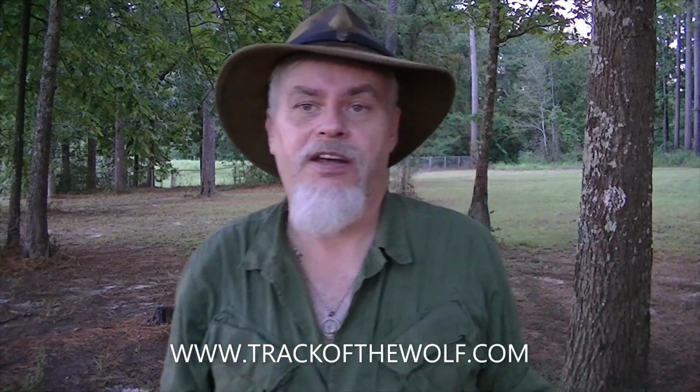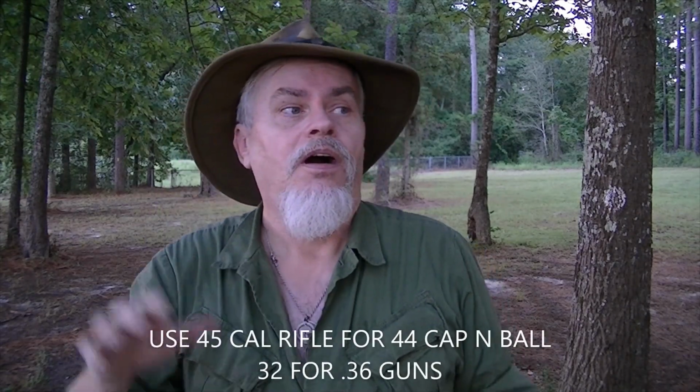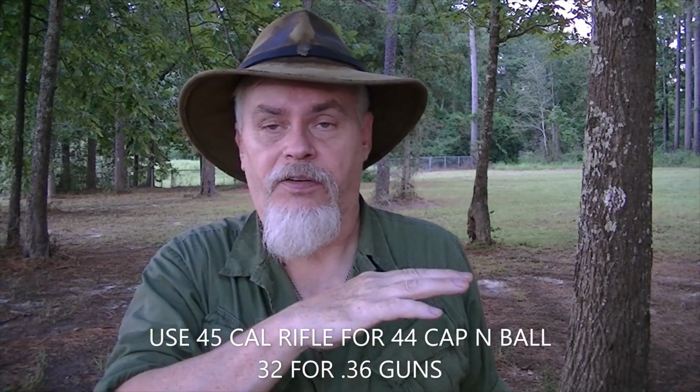Now, I know what you're asking, but Blackie, where can I get a ball puller like that? I got you covered. You go here. The name of that place is Track of the Wolf. You're looking for a ball puller with a collar. They're under $5. Now, you're going to see 2 sizes listed. Remember I said this one came off of Thompson Center? Almost everything out there that I'm aware of is an 8/32 thread. That's what screws in. Thompson Center had to be better, and so they were a 10/32.